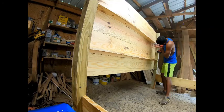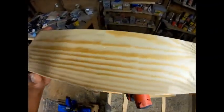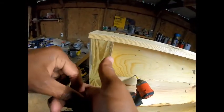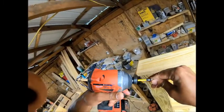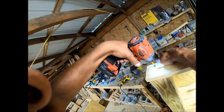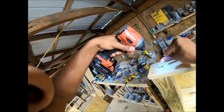Attach those to the back and you can also run screws from the back through them. Then I went to the top and slid on just the top runner piece — nothing fancy here since you won't see the top. I attached it with some two-inch screws through the top, just making sure to find the right spot for it.